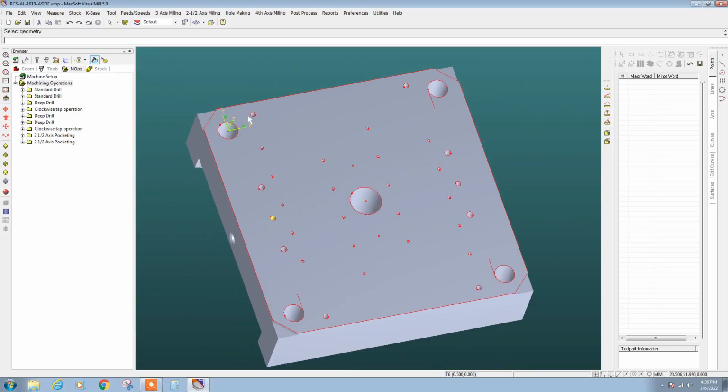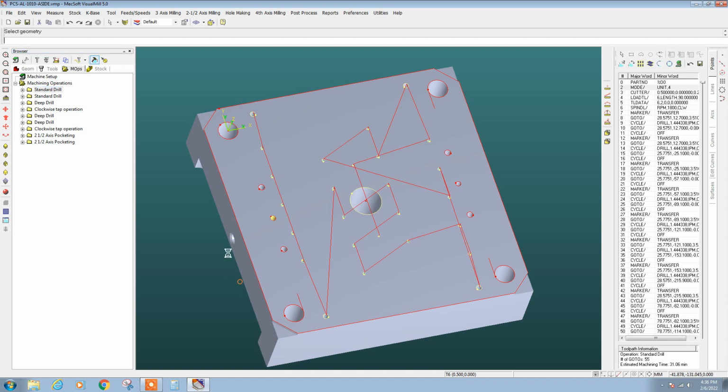And then that other highlighted hole, these holes that I'm showing you here, are going to be M6 holes that hold the reference plate down to the surface of this aluminum mold base. And then the center hole in the middle is going to be a clearance hole for the nozzle to go through and inject the plastic.